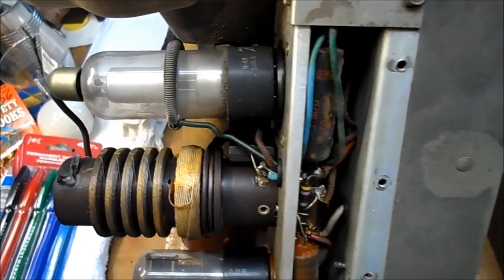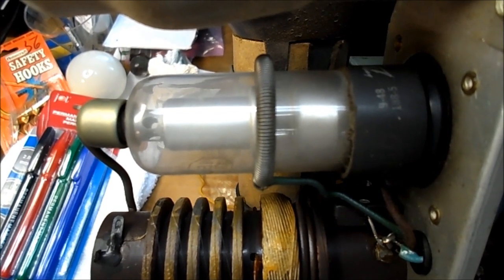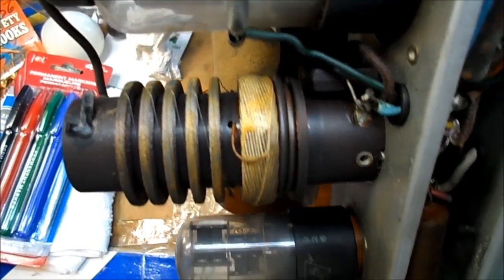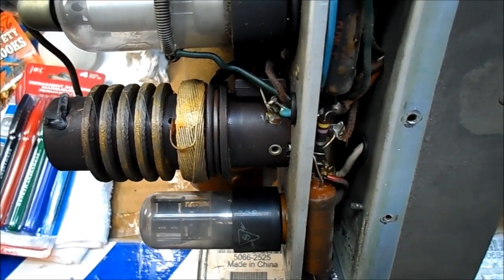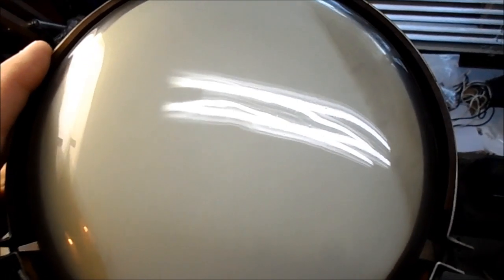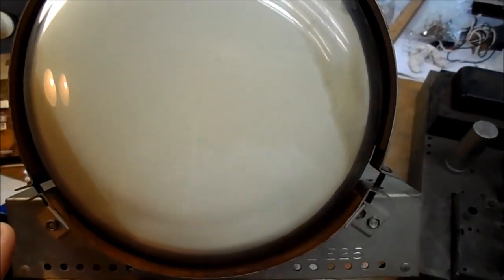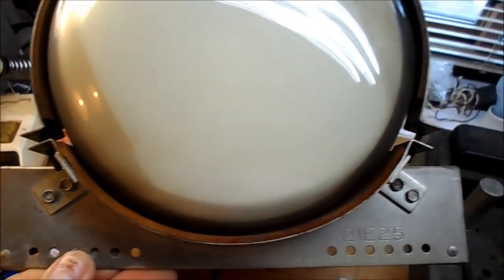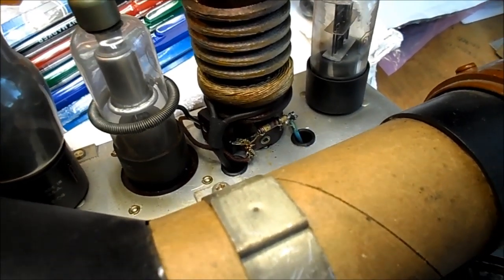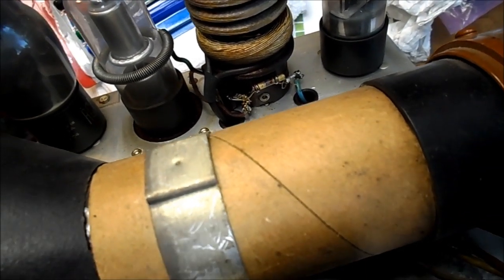I want to make note of where the feedback for the 1B3 is — this is a feedback spring just under the bottom of the chassis. Here's our high voltage air coil flyback, and there's something on the other side: the mica capacitors. This is our tube, and although it looks crooked I'm going to hold off on cleaning the glass because I want to see where the picture was before. There's the filament winding for the 1B3 wrapped around the base of the flyback, and two mica capacitors there.